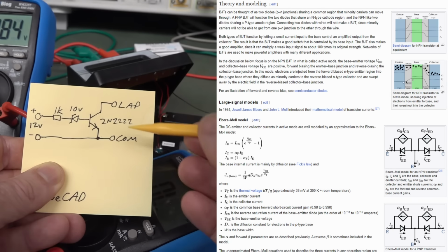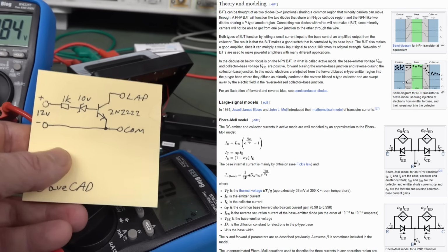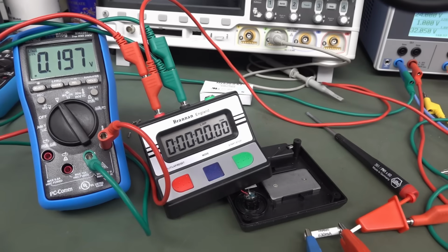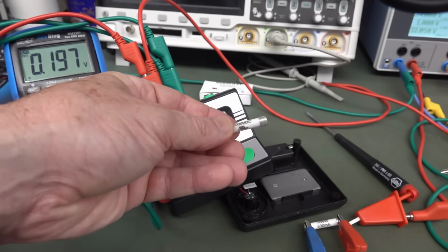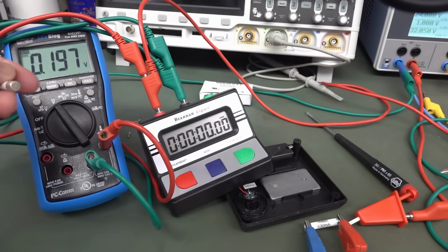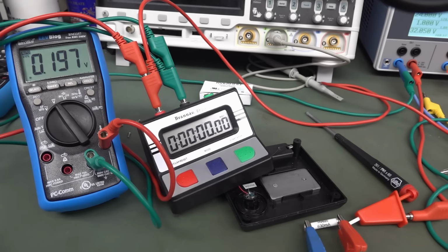So that can cause you problems. But anyway, let's fix our bloody diode goof and try that again. All right, let's see if it works this time. Now, one thing I just noticed is that my fuse actually blew. My 630 milliamp fuse, and you saw that it was 0.6 volts before. Well, now it's actually 0.2 volts again, because I've got a brand new fuse on there.